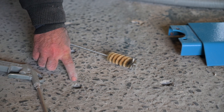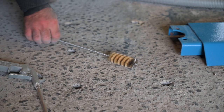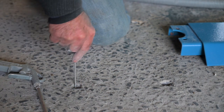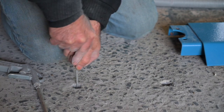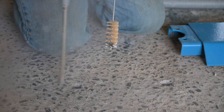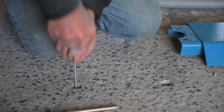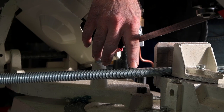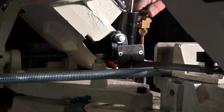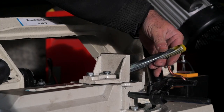The holes that we just drilled were 20 millimeters — 2 millimeters bigger than the actual threaded bar that we are going to put in. Now we need to make sure that all the dust goes out; that's very important, so we need to clean all this up very nicely, about 3 times. Now I'm going to cut some threaded rods out of this bar at 18 centimeters to put them in the holes that we just made.